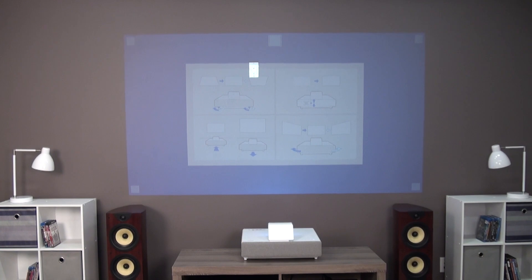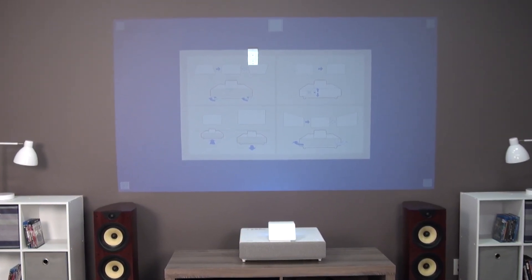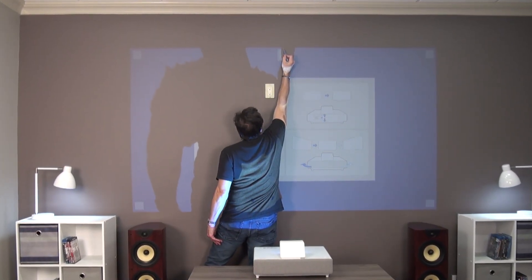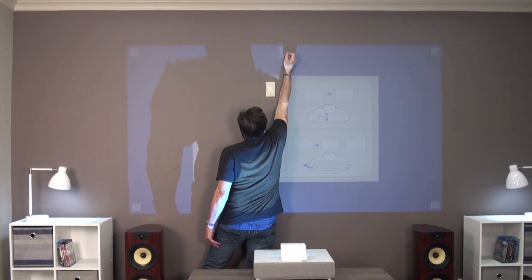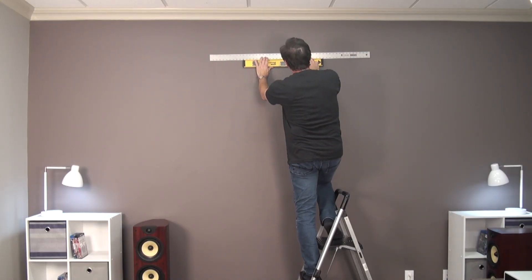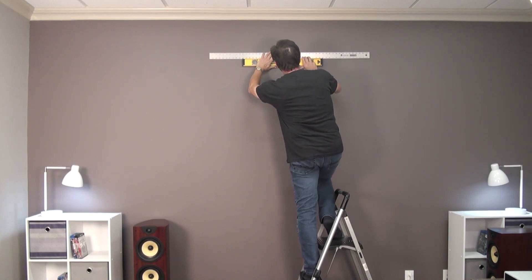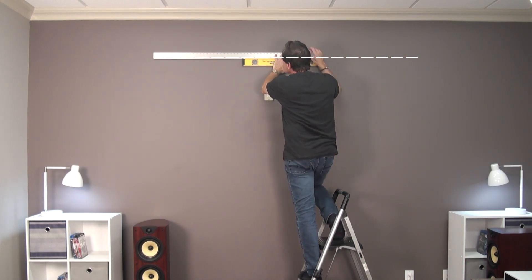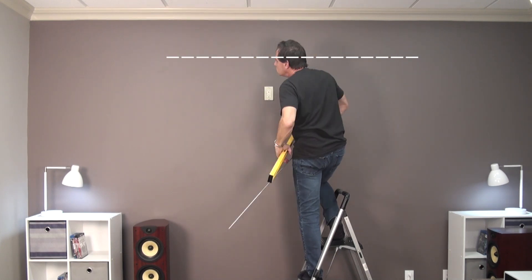Once you feel like the furniture and projector are about where they need to be, square off the image as best you can by twisting the projector left and right and using the adjustable feet at the front of the projector. It doesn't have to be absolutely perfect at this point, but get it as close as you can. Then mark the wall with a pencil at the top of the image right at the center point. You're going to use this mark to draw a horizontal line that represents the top of the final projected image. I noticed that the LS500's big lens imparts a very slight bow at the top middle of the image, so I marked about a quarter inch below that at a point more or less even with the height of the corners. At this point, you can remove the projector to keep it out of harm's way and use your mark at the top of the image and a laser level or bubble level and straight edge to draw a perfectly level line across. You don't need to draw the full width of the screen, but you should go far enough off the center point that you'll cross at least a couple of wall studs on both sides.